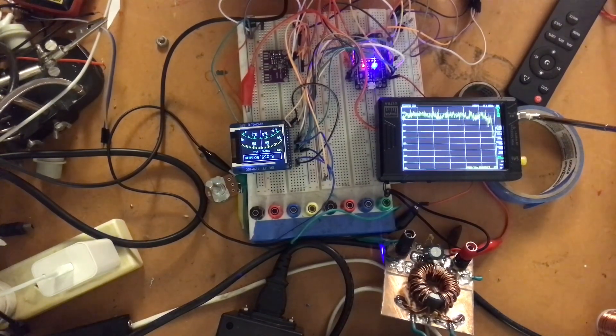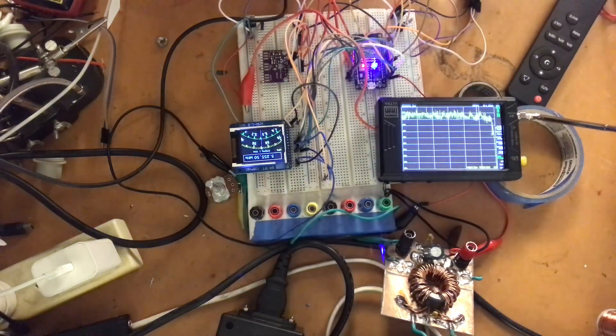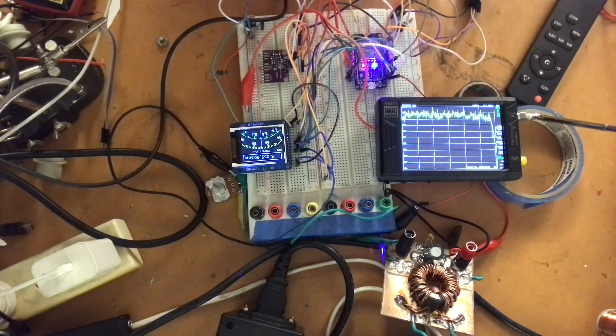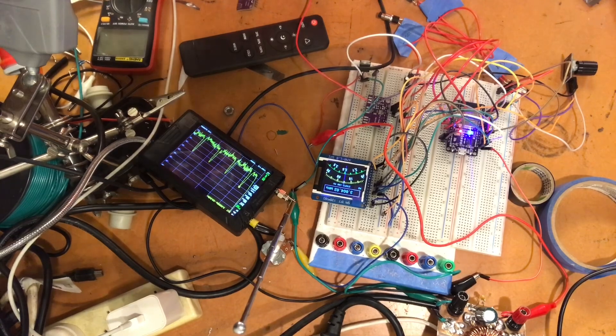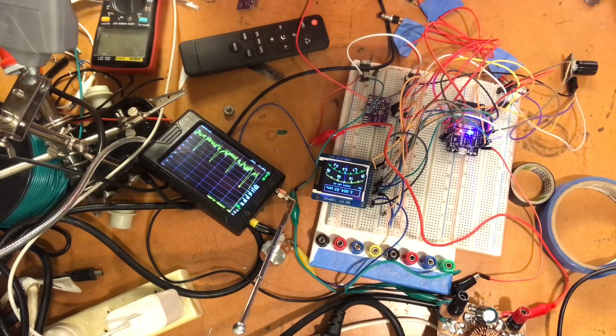I am way more than ecstatic — a lot of challenges happened with setting up this circuit. The screen I had wasn't the same as the reference design, so I had to research the pinout and which pins needed to be shorted. When I finally got it working the screen came on, but the VFO was jittering and not actually moving — that turned out to be bad wiring to the ESP32. Then I had the SI5351A clock chip earthed in the wrong place, so the whole circuit worked but wasn't making any RF.